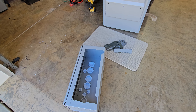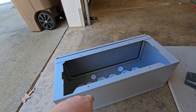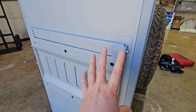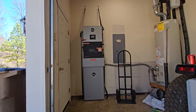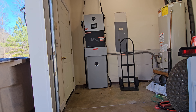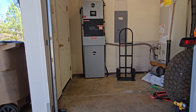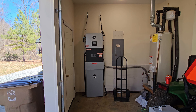So those are my tips: remove the plates to connect the battery cables, use the bracket screws to pull the battery side to side to align it with your 18K PV, and use cargo straps to hold things in place and lift if you're working by yourself. Hope it helps somebody out — thanks a lot.